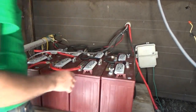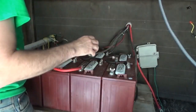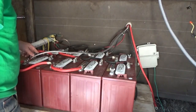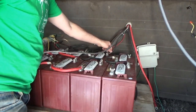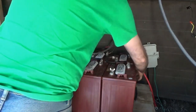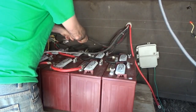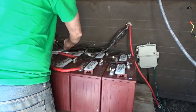I've got the power inverter connected inside the tiny house on wheels and I'm about to connect the final wires. This is to the power inverter - I've got the heavy double-zero gauge wire going to the inverter and then the 4-gauge going to the solar charge controller. The charge controller is putting power into the negative terminal on one end, so the power inverter is going to connect to the opposite negative terminal. We're pulling current from two different sides of the battery bank.